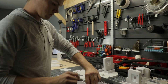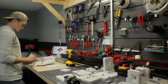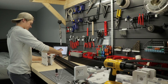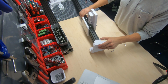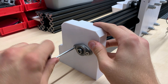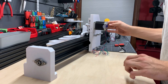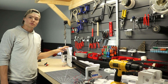The carriage on this linear rail uses a double-sided system with 12 V-wheels sandwiched in the middle. To put together this sub-assembly, two wheels are separated by various 3D printed spacers and washers, all slid onto an M5 by 100 millimeter bolt. With the left Y axis assembly completed, we can move on to the right Y axis assembly.